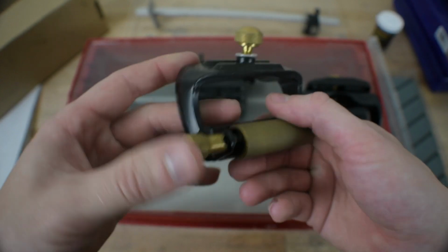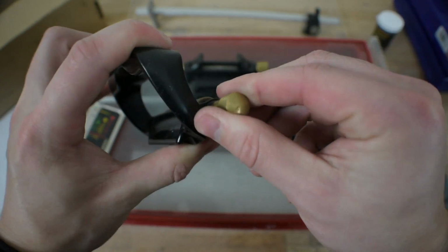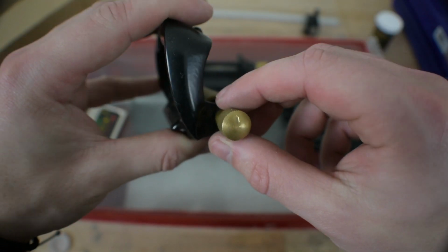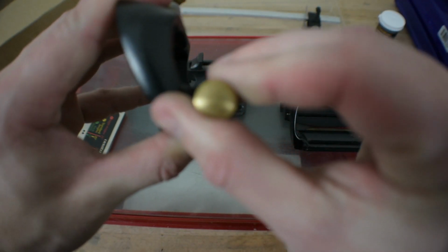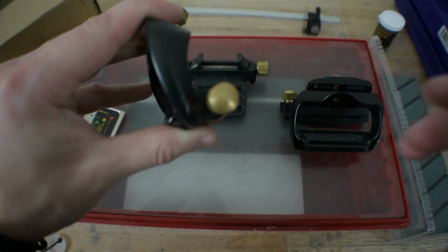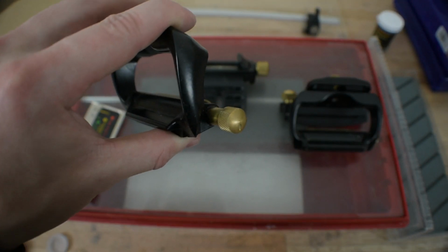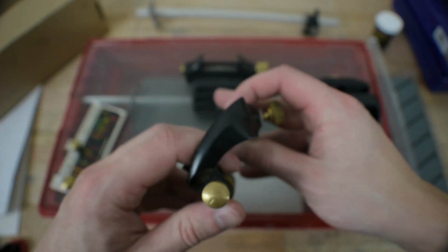What makes this set super easy is that it's in the down position. So with this little nubbin pointing up, it is exactly what degree you set it at. But when you lock it down, it is 2 degrees more for, say, the micro bevel. So that just makes this foolproof.